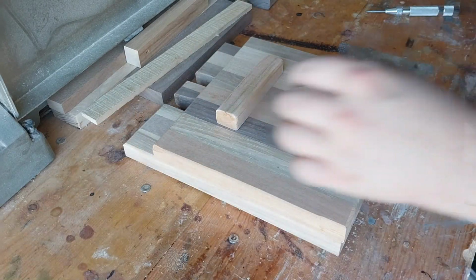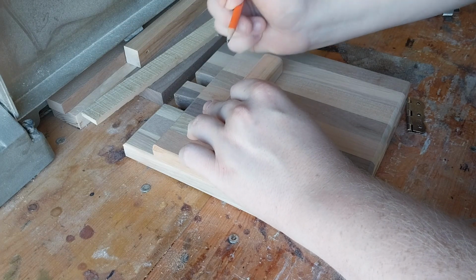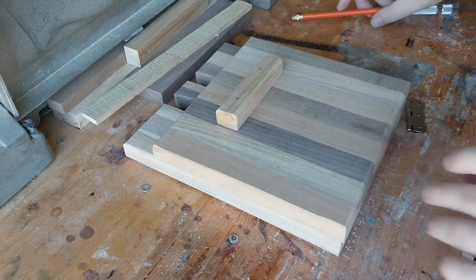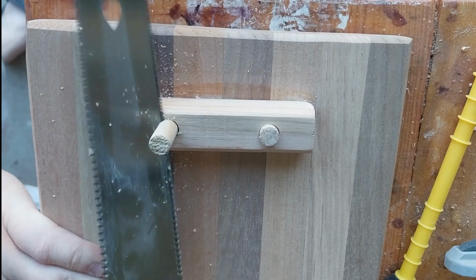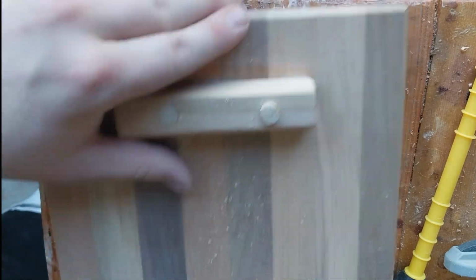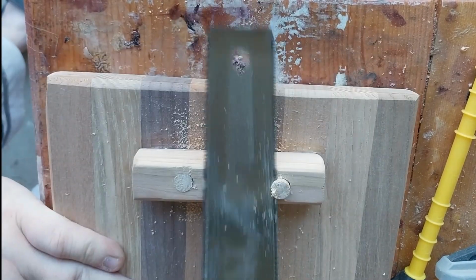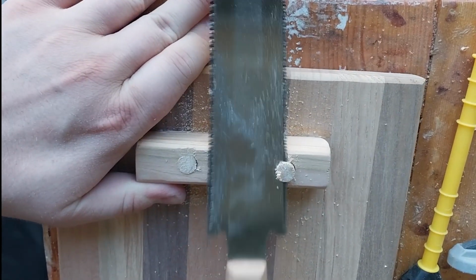Now this little cherry strip is going to be a little push bar on the top piece, and I'm just going to attach it with glue and wood dowels. Once the piece is glued on and the dowels are in place, I'm going to be using my trim saw to trim up the excess. And I can't tell you how much I recommend you guys have one of these trim saws in your shop. They're fantastic and easy to use, and they're very inexpensive.